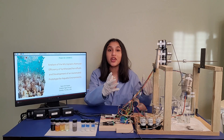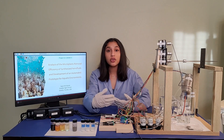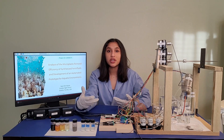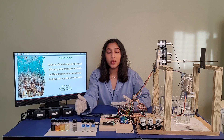The goal of my research was to develop an automated ferrofluid-based prototype to extract microplastics in aquatic environments. Ferrofluids are combinations of magnetite and oil. In order to achieve the ferrofluid combination that would extract the most microplastics, I used different types of oil, varying volumes of oil, and varying weights of ferrites.